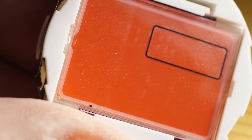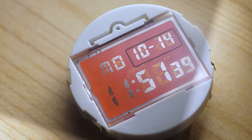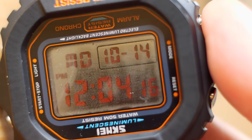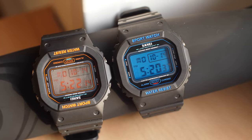And here's the answer. Everything's orange now. Add a polarizer and the digits appear. But the orange is not transparent. The only conclusion I can draw is that the liquid crystal itself is pigmented, thereby not only blocking but diffusing light as well.